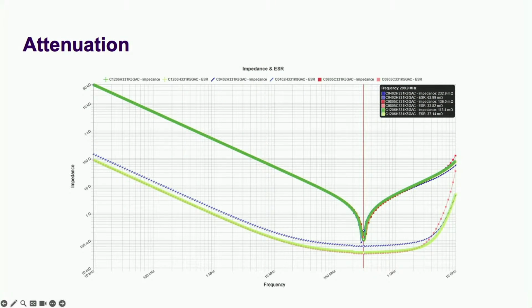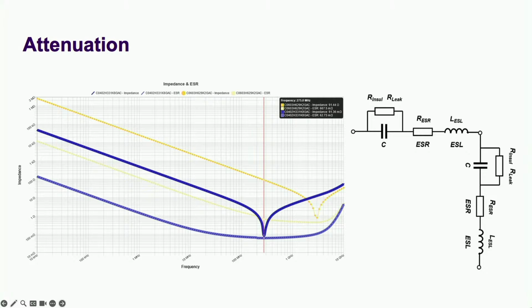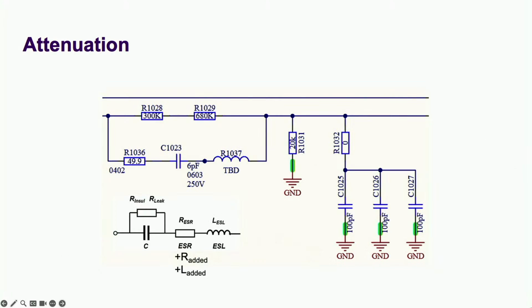This didn't seem like a problem I could fix with a component swap. The way I saw it, my problem was the lower capacitor had one impedance curve, and the upper cap had another. So in the same spirit of the compensated attenuator, I added a resistor and inductor to make the top half of the divider have the same impedance curve as the bottom half, which should maintain the 50x ratio of the divider at all frequencies.